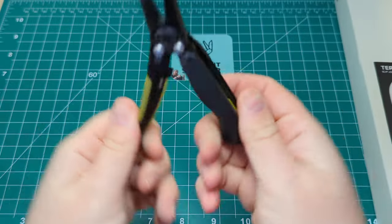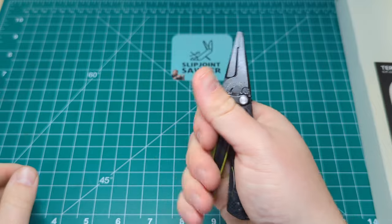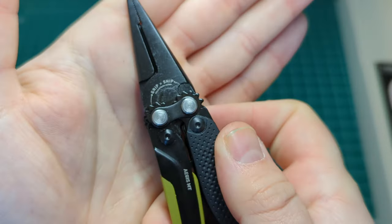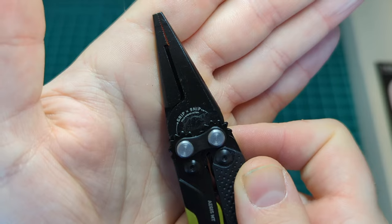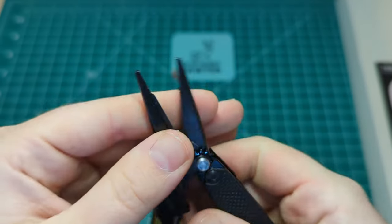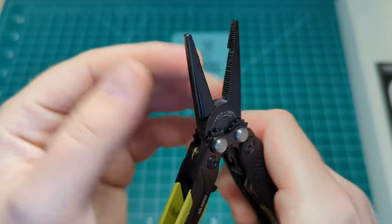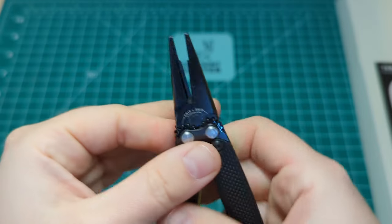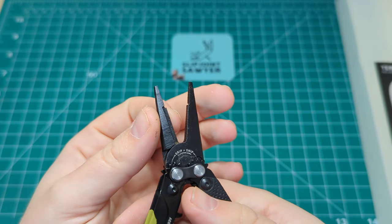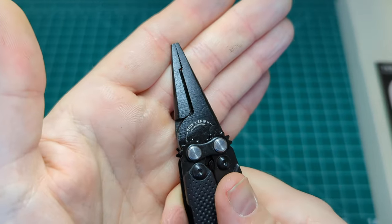The main function of this of course is the pliers. I'd use the larger part in my palm and the smaller part on the other side. Very nice spring action as well. You can see the grip and snip mechanism there — it's fully spring action. What I was mentioning about the grip and snip: the snips have teeth all the way down at the very end, so it would take hold and then snip. I think that's great because if you're cutting through wires, with normal pliers they can slide out the top when you squeeze. But with this I've not had that trouble at all — it fully covers over each other and snips through stuff you really think it shouldn't be able to.